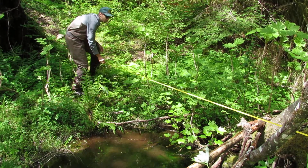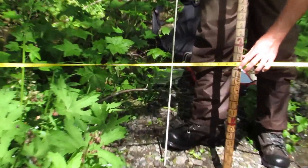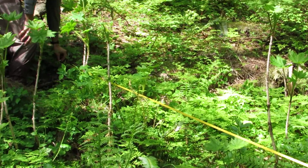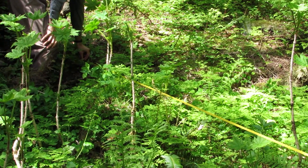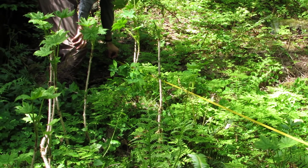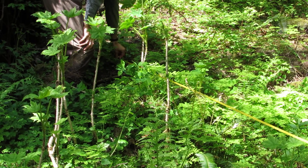Zane is coming across, and you need to make sure that it's level from the 1.8 feet on the depth rod — level all the way until you hit bank on the far side. You will take that distance and add it to your bankfull. It's 20.2 feet from the bankfull spot to where the tape hits the bank on the left side. Do that on the right side as well and add them all together to get your full flood-prone width.